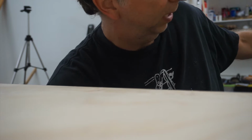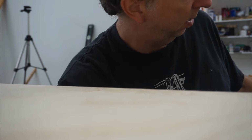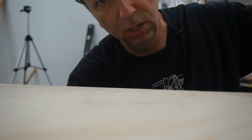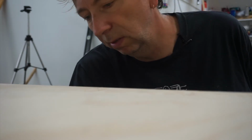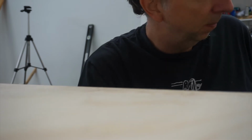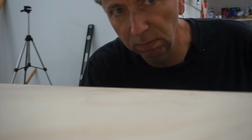So you go up 4 feet, and what that gets you is 4 feet plus the 1 foot that you already have from the floor of the gypsy wagon. So you're already at 5 feet at the outer edges of the gypsy wagon, and then you have the arch creating even more height in the middle of it. All those things lead to a pretty decent amount of interior room. You don't want to go so high either, because the higher you build, the heavier it gets, the more wind resistance you have on it. We'll start to think about cutting it out, which is super frightening. Anyway, here we go.